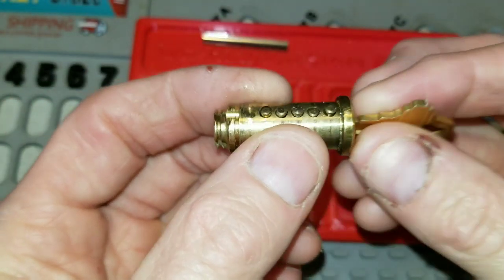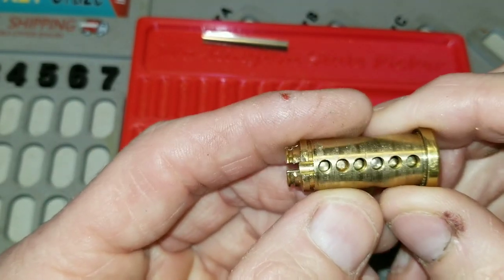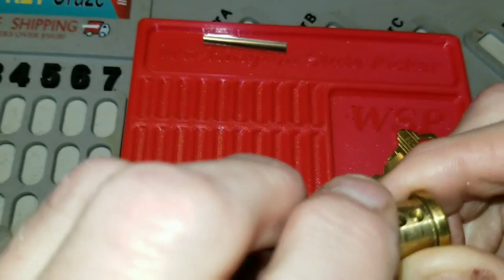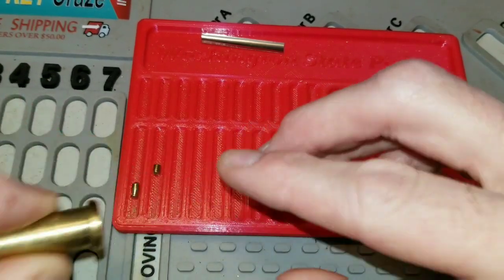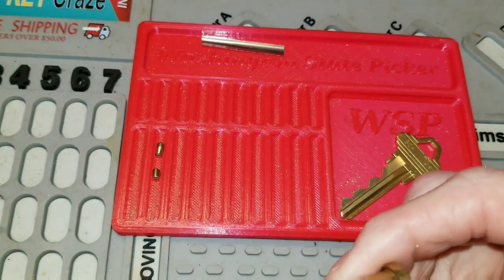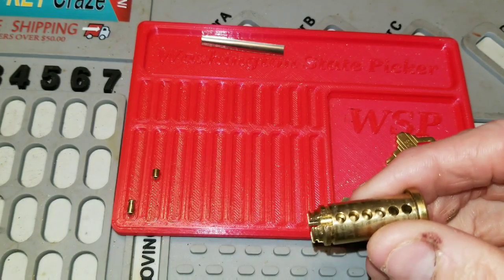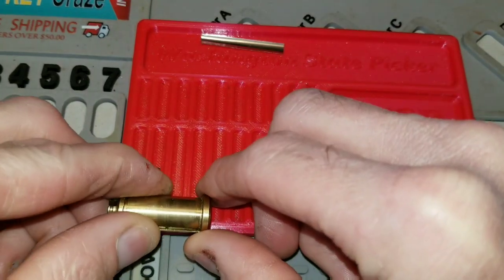Did it without dumping. Everything works smooth when I thread the cylinders. There is slight threading — or is that undercutting? That must be undercutting; I don't see any threading. When I thread stuff, the pins get stuck. I had to throw away a perfectly good lock because I broke the key off and couldn't get it out — threaded cylinders, strong springs — it was a Yale cylinder. So I'm not threading cores anymore, and if I do I'm going to slightly sand them.